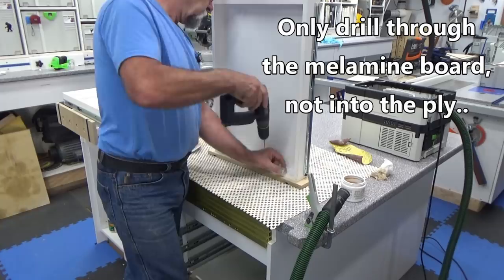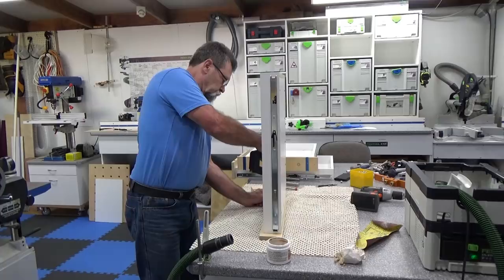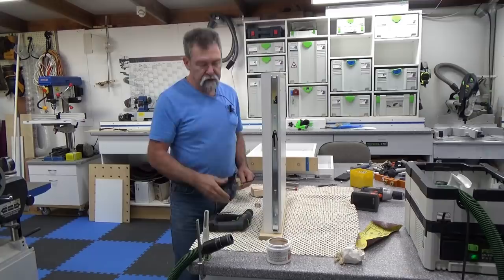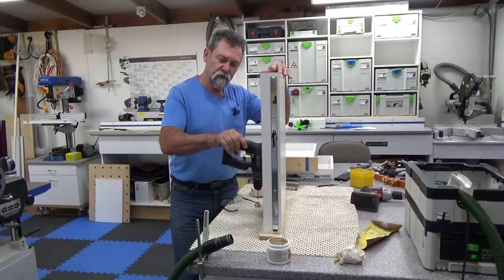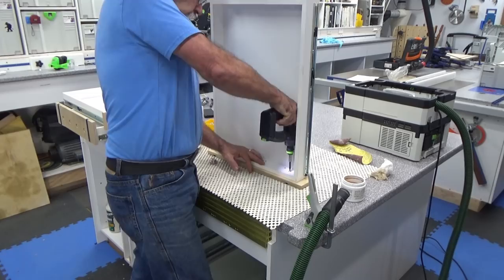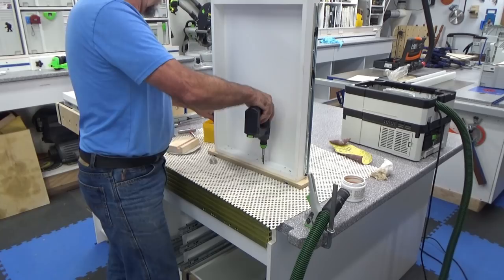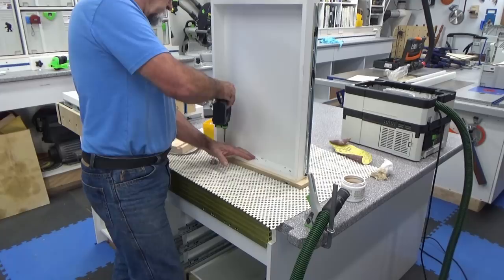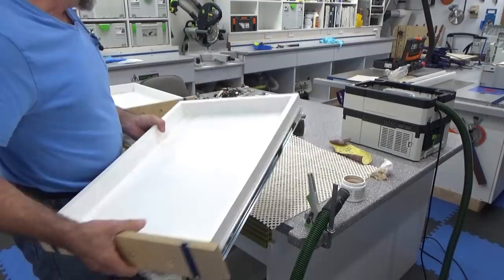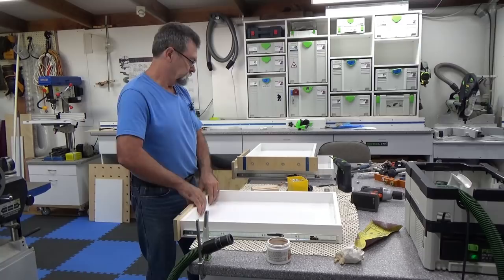One, I'm just going to put three across. And up here. The distance down that I'm going is governed by how close in my drill body can get to the base of the drawer. One. Three. Now I can remove these screws at the front. Done. Now we can put the 3mm drill back down through those holes.